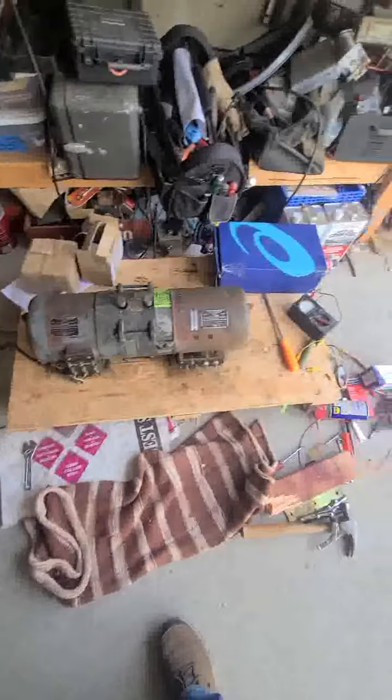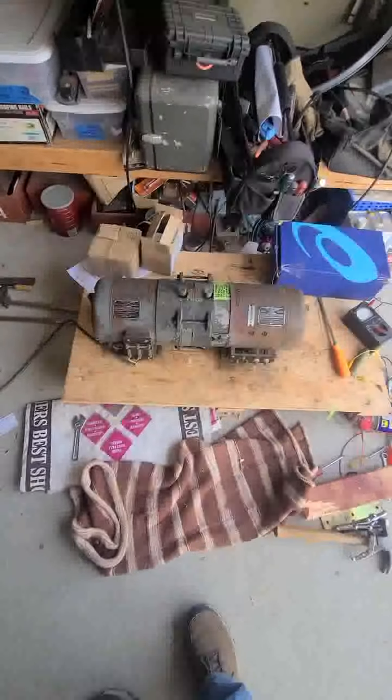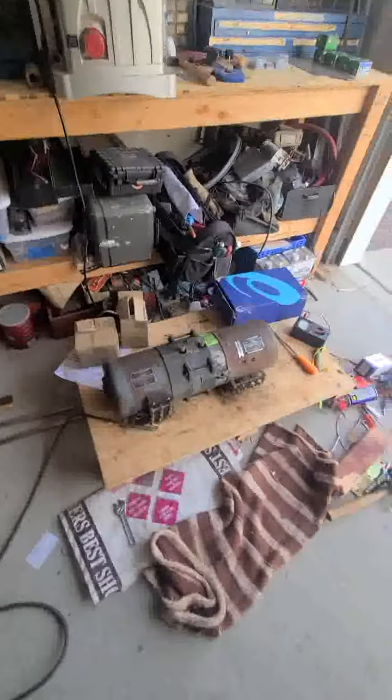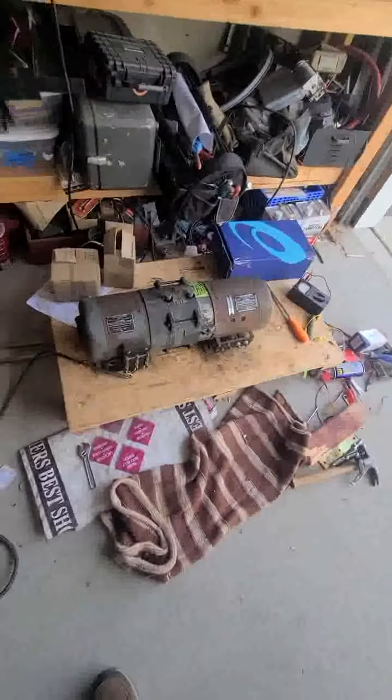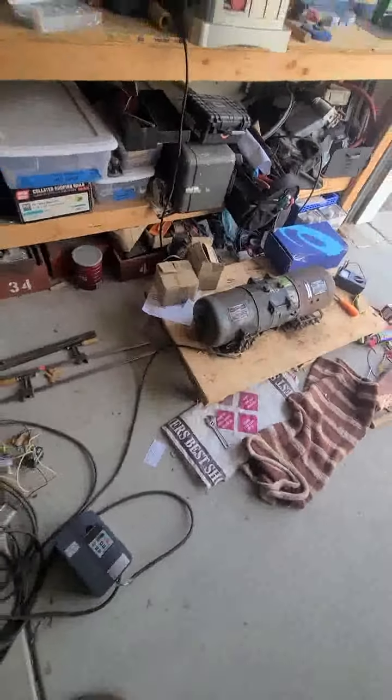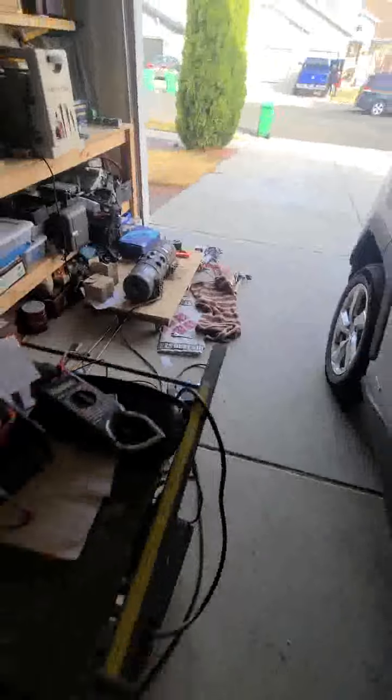This is the motor generator set. I had totally torn it down. Totally. I had a machine shop make one new part that was missing. I've shimmed out the shafts, put new bearings in it and the rest, and made a 3-phase converter.